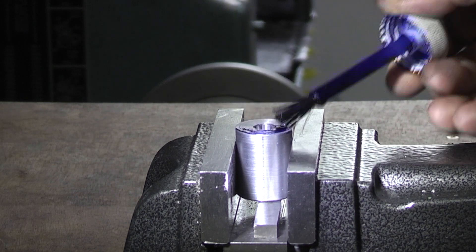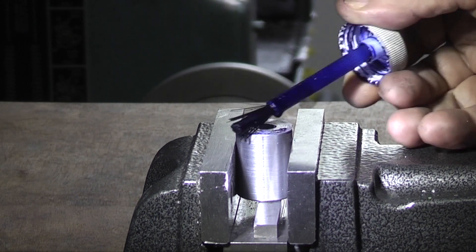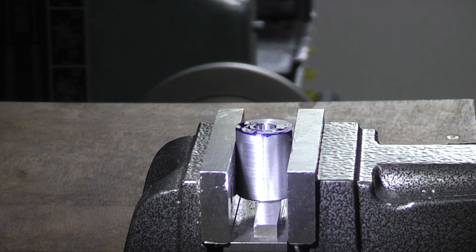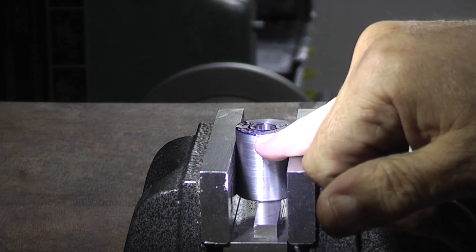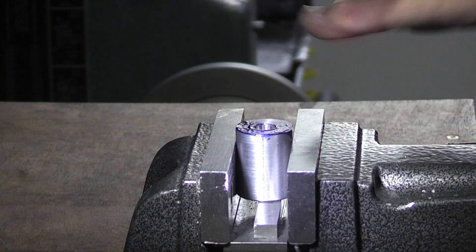Don't need the whole lot marked. The lower side of the tilt. So when I machine this flat I can tell when I reach this side with the milling cutter, and that's level. I can then start to put the slot in.